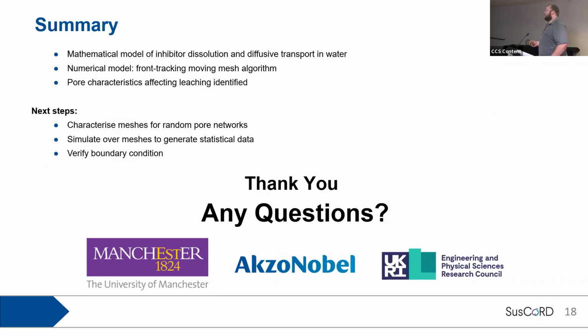Hopefully not. Because I'm using circles, we only have one contact point, an infinitely small singular point. I think the particles themselves are more crystal shaped, but it's still only going to touch at one point typically. Well, in terms of space, two circles will have a single dot, whereas if it's got straight edges, if there's a slight overlap, where the polymer hasn't completely wet round the surface, you would get a slightly larger contact. Mechanical contact theory says it's a pretty small contact point.